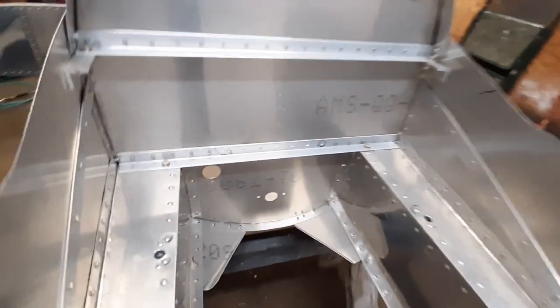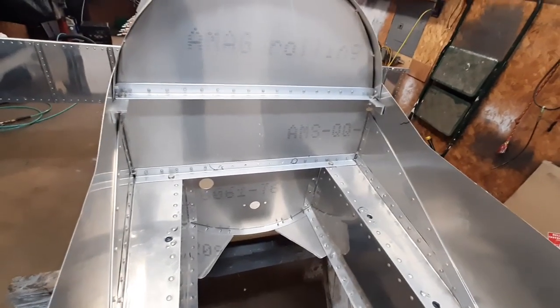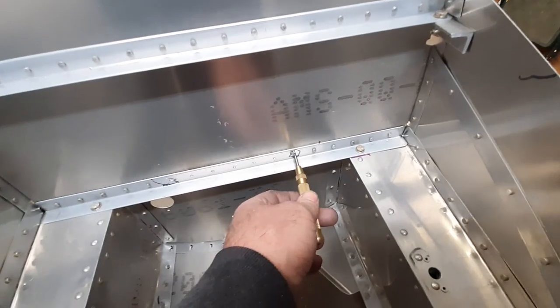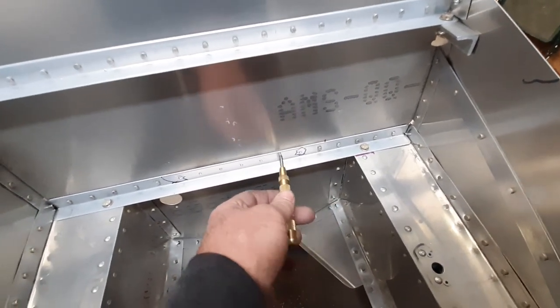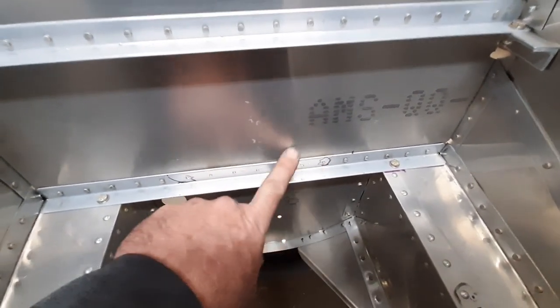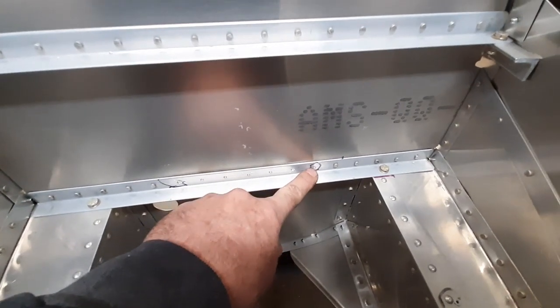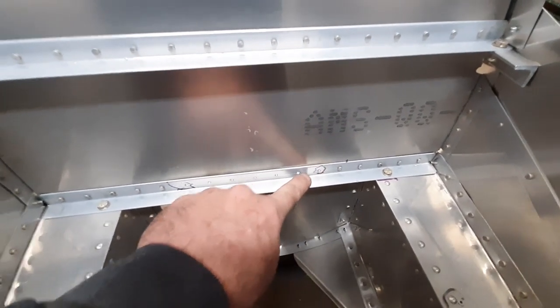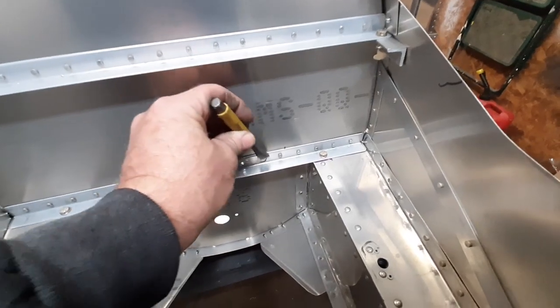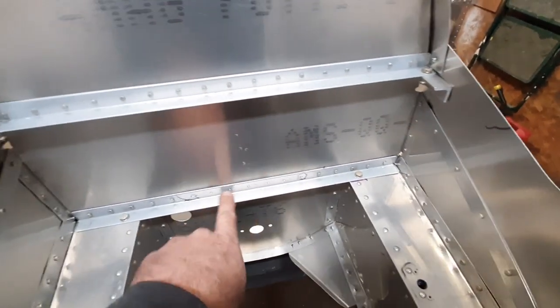All the rivets are out. That was slightly more difficult than drilling out a pull-type rivet because it doesn't have an automatic center hole to start with. What I did was use my center punch on the flattened side of the rivet, marked them all, then drilled just about to depth using an 1/8-inch drill bit — since these are 1/8-inch rivets — without going all the way through in case it was off to one side. Then I just took a flat chisel and gave them a little tap to knock the head off, and then could push them right on through.